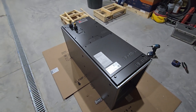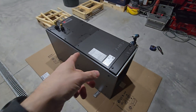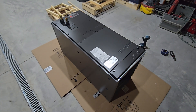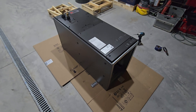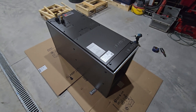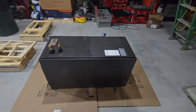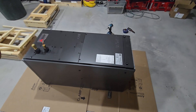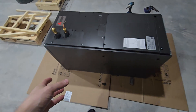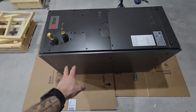Instead of having a separate outdoor unit for each air handler, you can combine them into one. This is a 24,000 BTU air handler and I have two, so the outdoor unit needs to be about 48,000 BTUs. I'll look up the available sizes and make sure I'm sizing that correctly. I'm configuring these units now, then bringing them upstairs on a lift to mount them, connect all the ductwork, run the electrical, and run the refrigerant lines out to the outdoor unit.